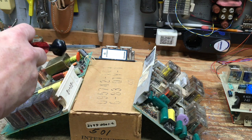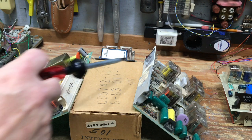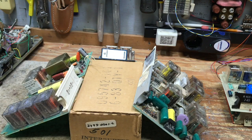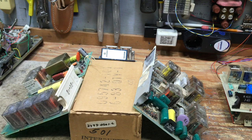Then we have a Sandbar 4000 KTU, which again performs the same exact function as a 400D. And then we have 2 Automatic Electric KTUs. This is a very early Automatic Electric, and this was a later generation when they changed it to GTE. They are interchangeable with the rest of the KTUs. What's interesting about the Automatic Electric KTUs, they are probably the only item that Automatic Electric made that was ever interchangeable with any of the other equipment manufacturers. So you could again take a Western line card and replace an AE or vice versa.